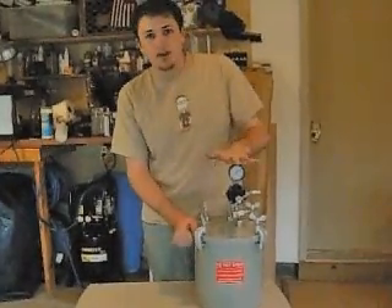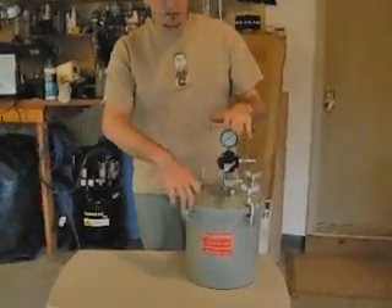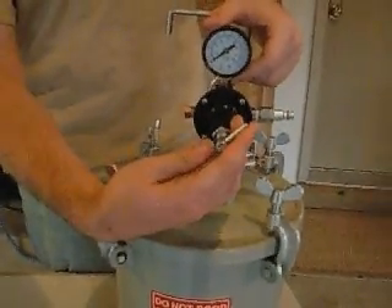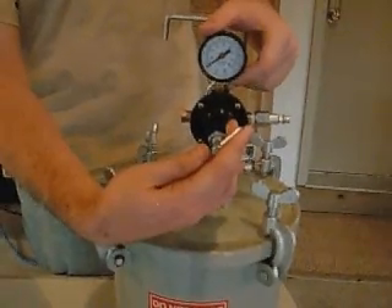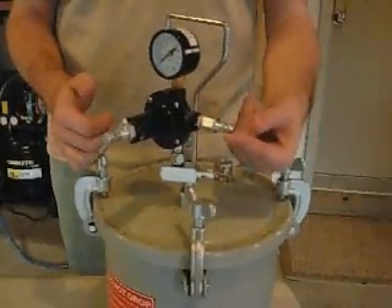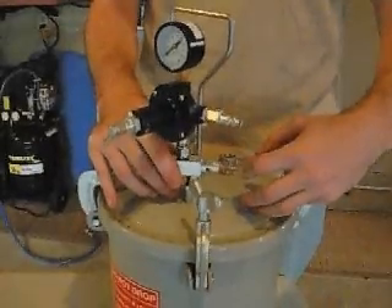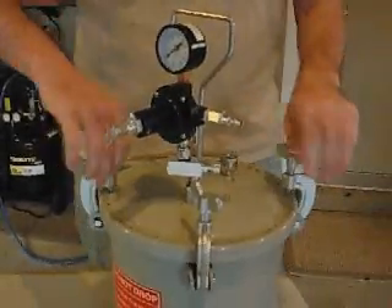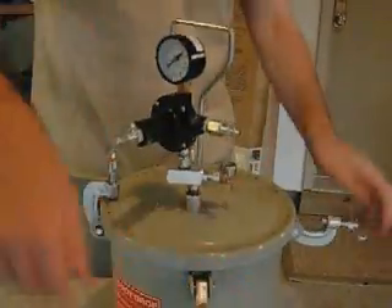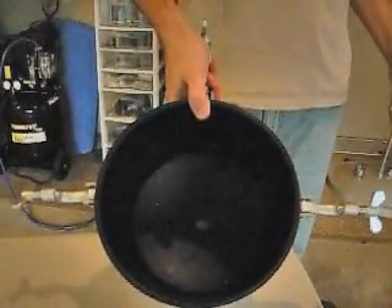This particular pot is intended for painters. It's got a valve right here that shows you the pressure going in, and a little screw you can use to control and adjust the pressure inside the chamber. Over here there's a valve that hooks up to the compressor — that's where the air comes in. This is a blow-off valve: if the pressure gets too high or you need to vent it, you pull this pin out and it blasts air out the sides. And if you take a look inside once I open it up, you've got a nice, big, empty area to work with parts in.